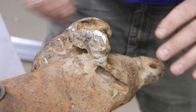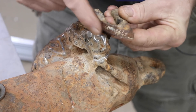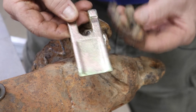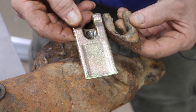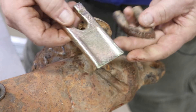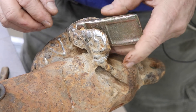Somebody's tried to hard face all the flute of the auger — it's very poor work. This is one of the teeth that was in here and you can see how it's shaped and pretty short. This is what it should have looked like, or what it did look like probably when it was brand new. You can see quite the difference there. This is about three and a half inches long. And this will fit in here just like so — we just need to make it stay in there.